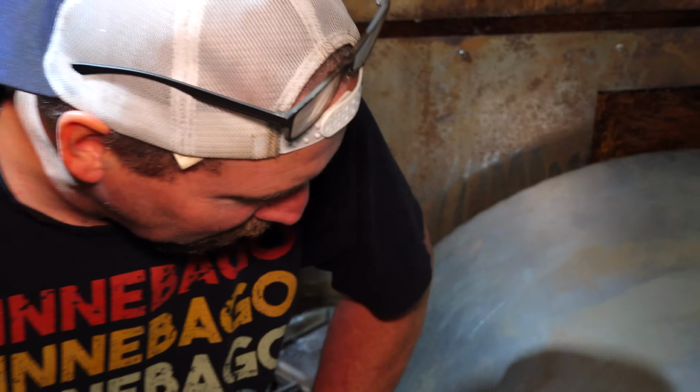All right. We're gonna take the cleco now. I just finished drilling this, so I'd use the angle drill and see how it sucks it right up. Yeah. Holds it nice in place. So this flange is overbent a little bit, so I'll knock that into place. I can spot weld all the other ones because I'm welding all this.